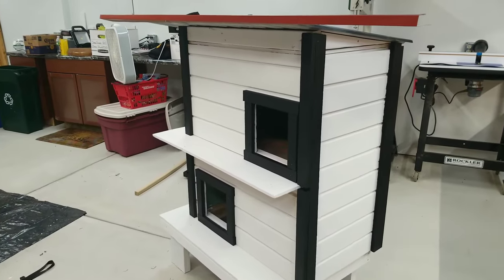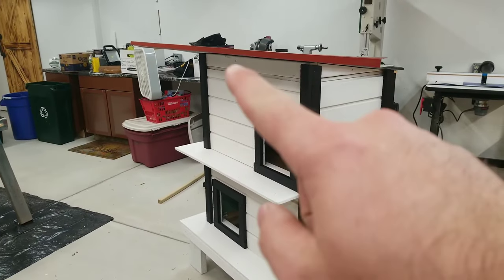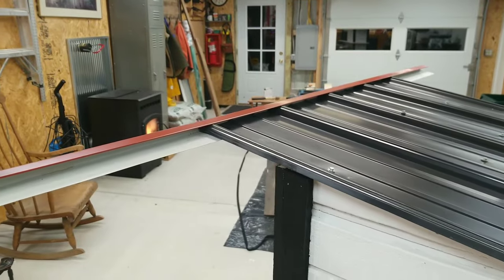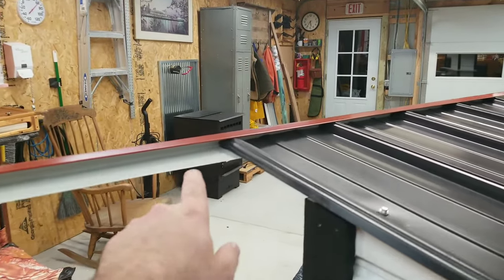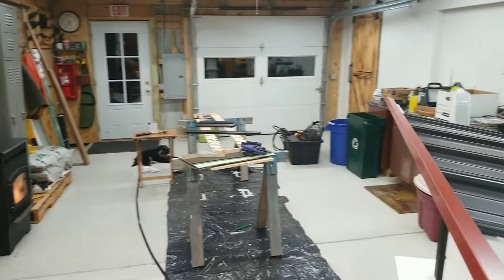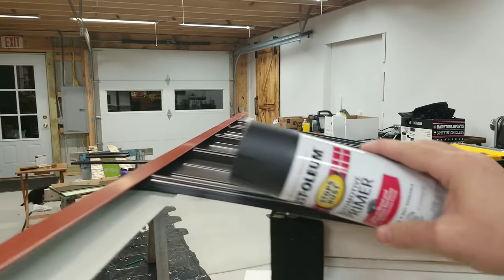There was enough video of me nailing up trim. I do have the last couple of oddball pieces that just got painted — that's going to be what covers up the 2x3s that hold the roof up. The last thing I'm going to do is I've got this piece of J channel. Yes, I realize that it's red — it was up in the rafters. I thought it was a whole piece but plans changed a little bit. I'm going to cut this J channel to at least protect these front corners — protect us from the corners — and then I have a can of Rust-Oleum that's pretty close to matching that I'm going to spray the red with.